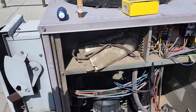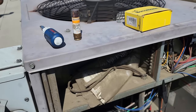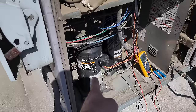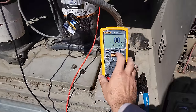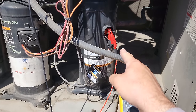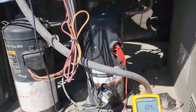I haven't shown you anything on this AC — I have someone else working on it — but we have a fuse that has blown. This fuse has blown before; another technician came out a long time ago and changed the fuses, couldn't find a reason. So I busted out the insulation tester, the mega ohm meter. We tested one motor — it was good to go. We test the compressor and it's testing bad. We're testing with 526 volts: we have 32 mega ohms, 61 mega ohms — an intermittent insulation issue. The compressor was just running and actually satisfied, but intermittently this compressor is shorting to ground.